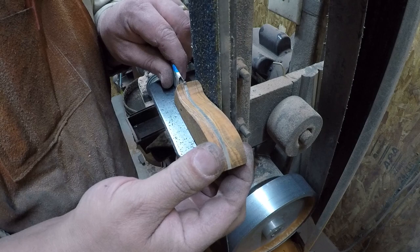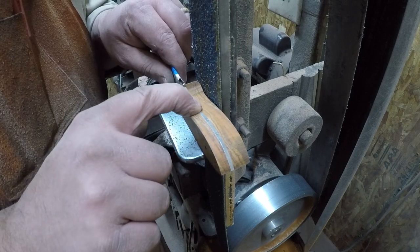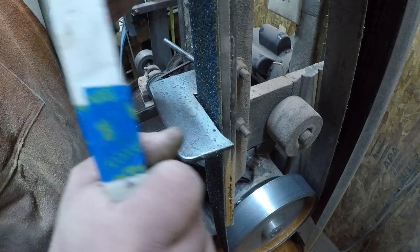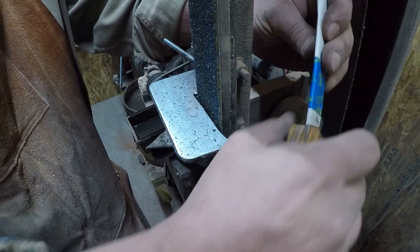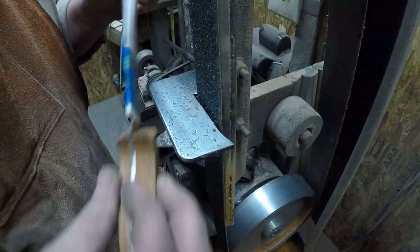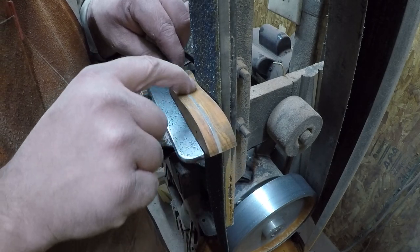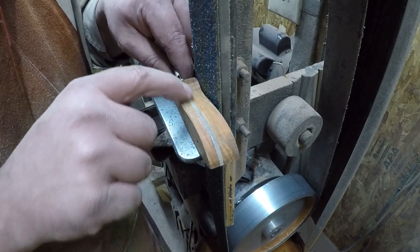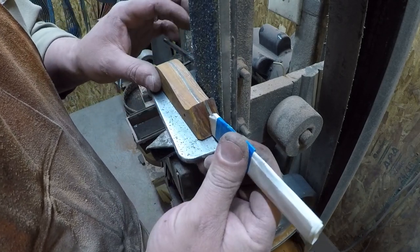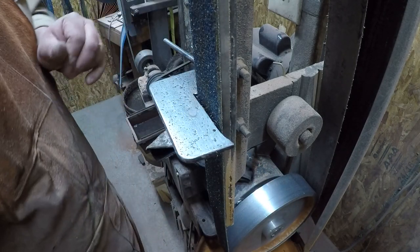Now I'm going to want to tilt the blade, the cutting edge, towards the belt, okay? So that way the front of this knife is going to be narrower than the back of the knife, okay? Because if you've got to do any power cuts like this, you want it to be fatter on the back than on the front, okay? So I'm going to tilt the blade in, and we're going to come up in here, and then smooth out the middle section to kind of match. And we'll come over here the same way, tilt the edge up into the belt, thin it here, bring this in to match, okay? We're going to do that on both knives, and then we'll stop again.